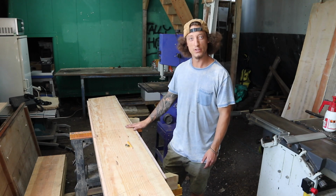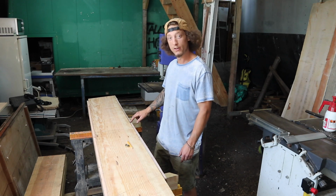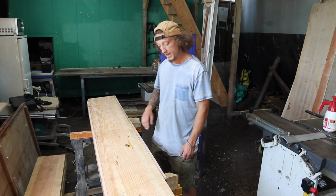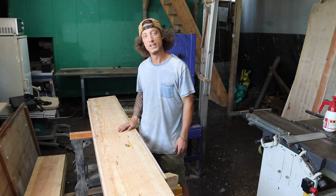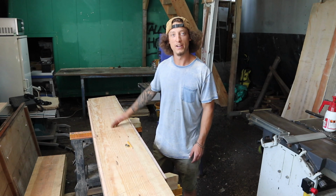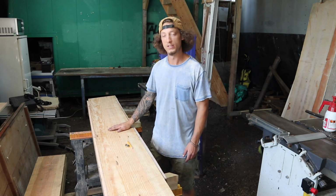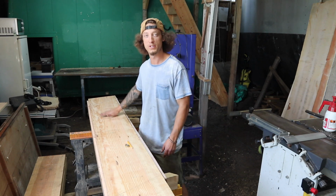I'm just going to get the skill saw set up and set it to the shallowest depth on some of these low points and just run straight across, giving myself a few notches and areas to work where I can just chisel out the majority of the wood and get it down close to the lines I need.